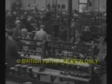From Prescot is the Heighton Quarry factory of the BI, where enameled wire is made. The wire has first to be wound onto special reels in preparation for the enameling machines. The enamel is applied by passing the wire through a bath and then an oven of closely regulated temperature, which bakes the enamel to a tough and elastic consistency.